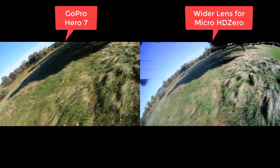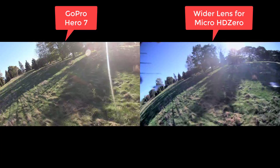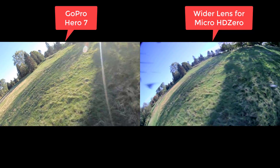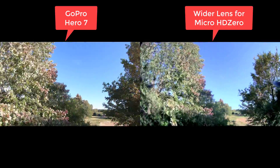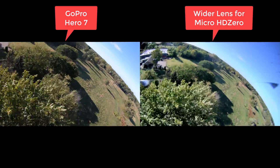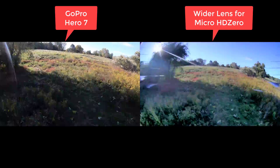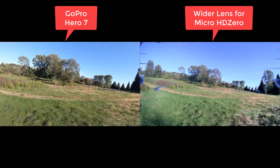This is a little sneak peek at some of the one-watt prototype VTX testing that I've been doing. This is preliminary and isn't final — the power output might not be full one watt yet; that's got to be verified with a tool. But it looks very good and very clear going through behind these trees. I'll also say the antenna placement on this quad was very suboptimal. Due to antenna sensitivity issues, I couldn't elevate the antenna above the battery, so the antenna is right behind the battery — which means if I fly back towards myself it will be worse reception by quite a lot, as the battery soaks up the RF.